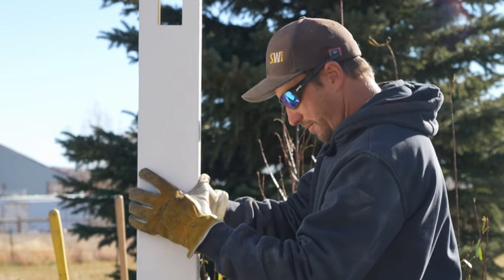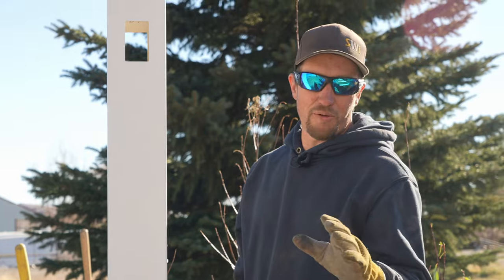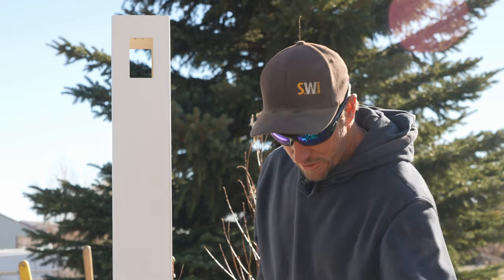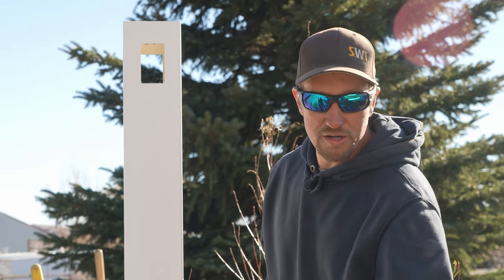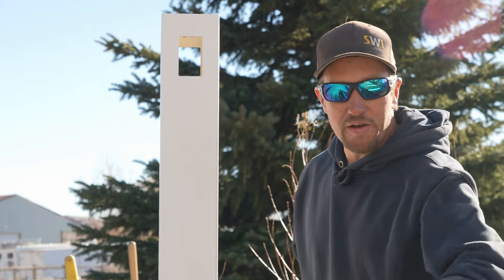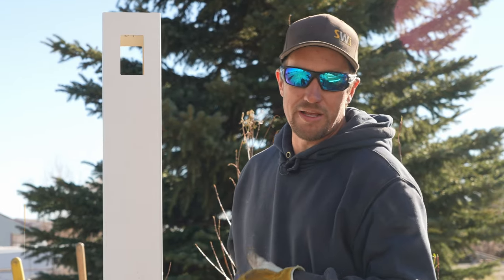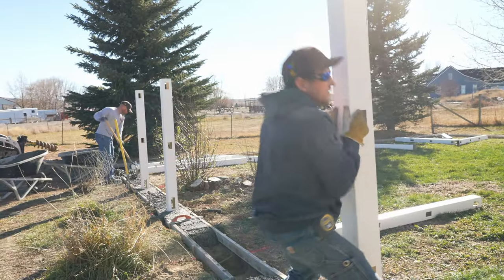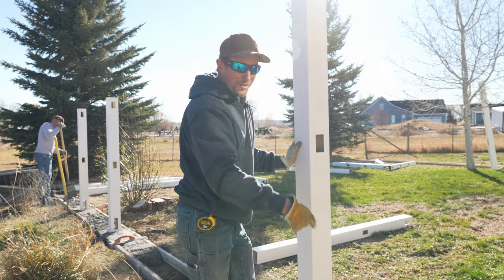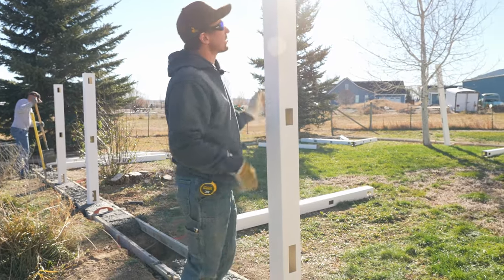Don't be worried about setting the flow of the height of your fence right now. The two big things we've got to worry about are: one, getting the post in the concrete, and two, getting that mow edge knocked down — getting the rocks knocked down so we can come back after the posts are set and start troweling, finishing, and edging it. At that point we're going to set height coming down at the same time. One thing to keep in mind: water is your friend. The wetter this concrete is — you don't want it soup — but the wetter it is, the easier it is to get these posts in the ground.